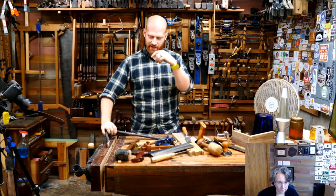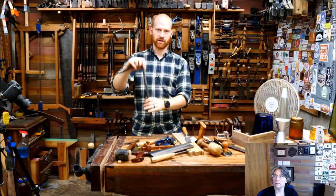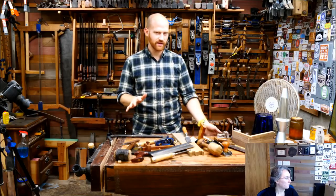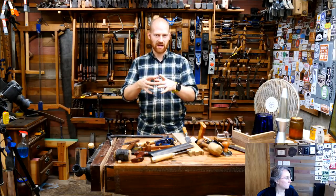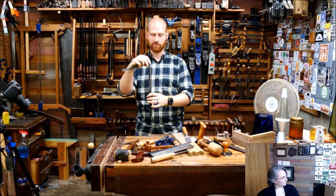Another thing you can do is you can bore out the inside of the hole larger. So from underneath, some people will use a taper bit and make it bigger on the bottom. Basically what that does is decrease the thickness of the top in that hole so that there is less contact space in the holdfast. In my opinion, the perfect thickness for a hardwood top is about 2.5 inches. So if you drill the hole in the bottom about 1 inch diameter up, an inch or two, and then you have a 3/4 inch hole going the rest of the way, that makes it easier to get the holdfast in because there's less bench for it to have a problem with.